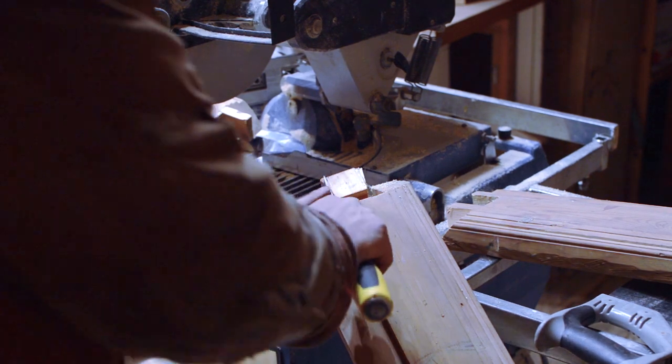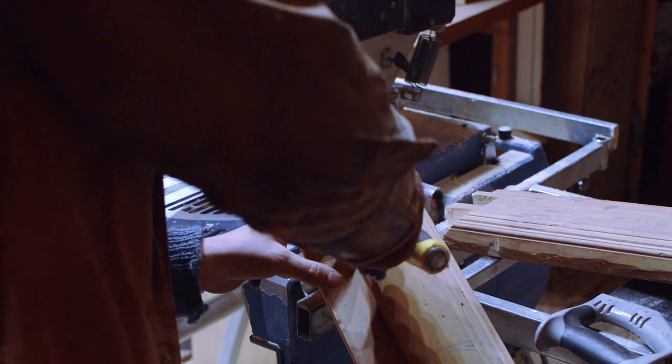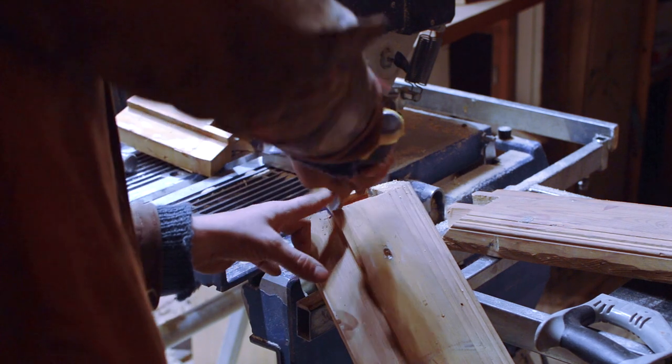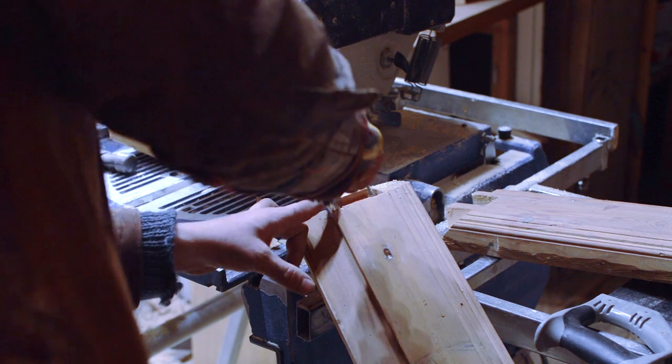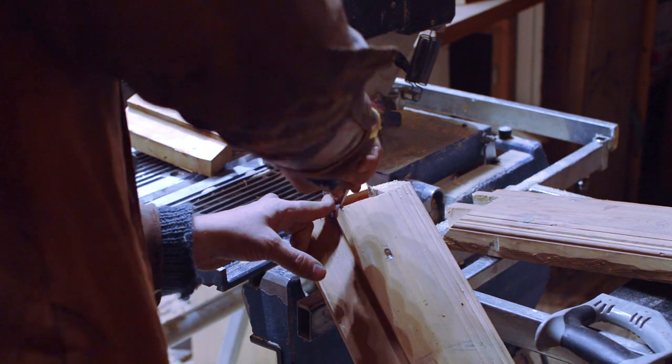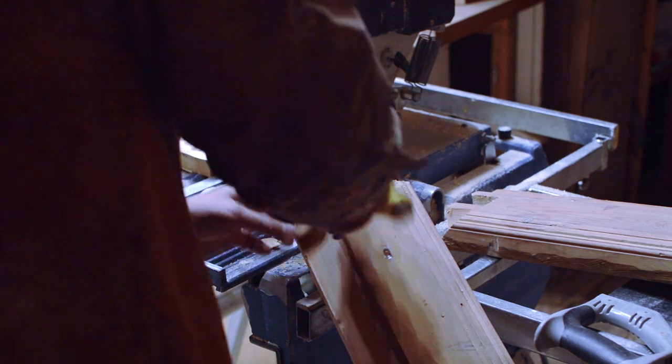I mean, they've put wedges in and they made it. We should just take them away. Looks like they might actually have been glued in. It's interesting because, of course, PVA is quite a modern invention, so they must have had hide glue heated on the building site in those days. Well, there's a nail sticking through there as well.